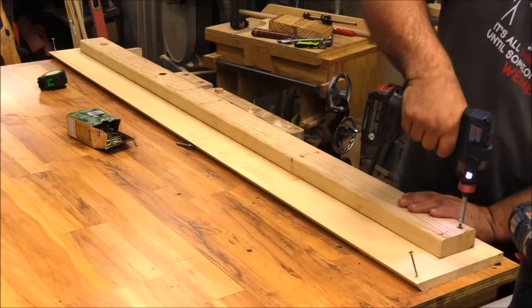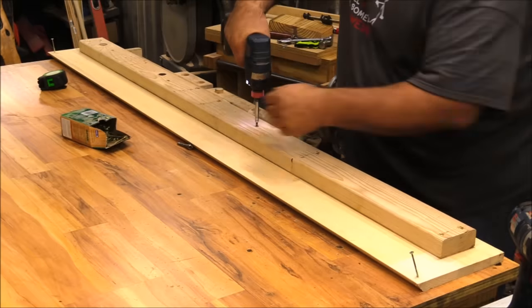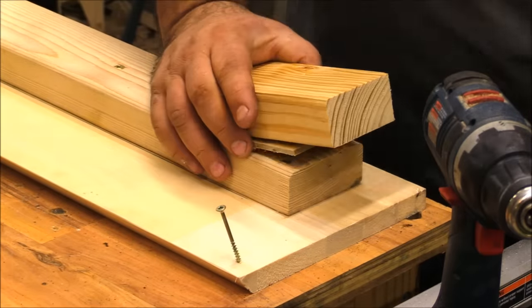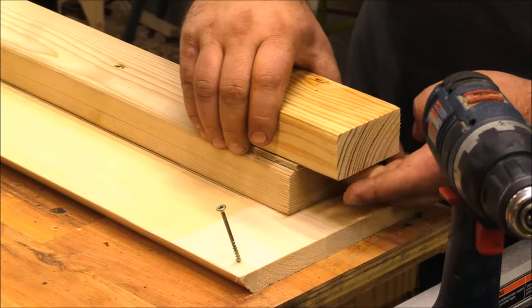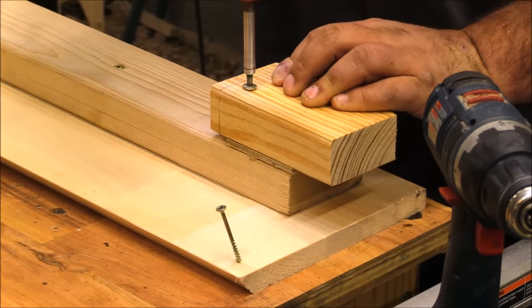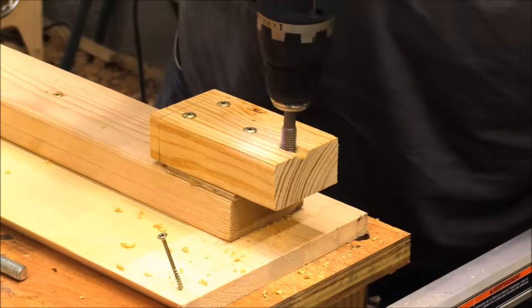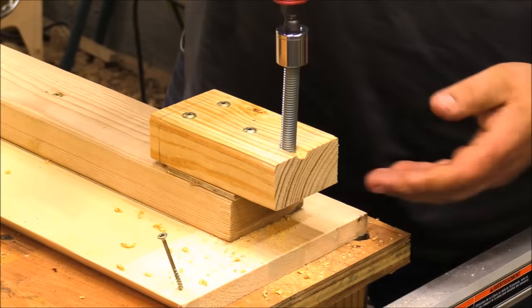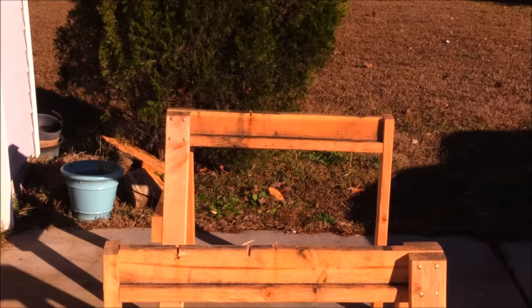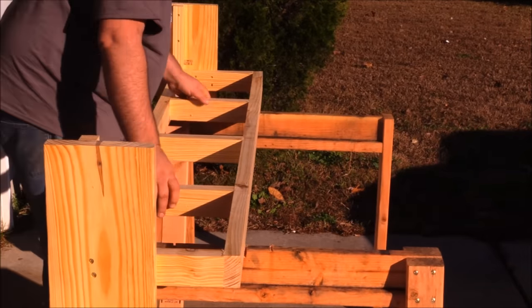With the angle set on the track, it slides really nice and easy. Because I made the slide out of 3 quarter inch material, I wanted to add some rigidity by installing a 2 by 4 along the back of the slide. To clamp it in position on the sawmill, I added some auxiliary blocks and drilled a 7/16 inch hole through them, tapped it out with half inch thread, so I could stick a half inch bolt in — it acts like a clamp on the tower slides.